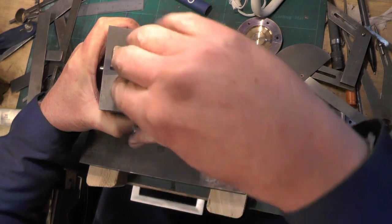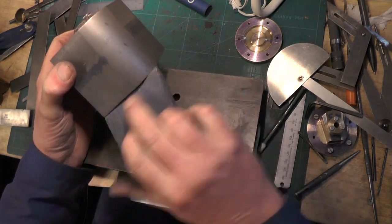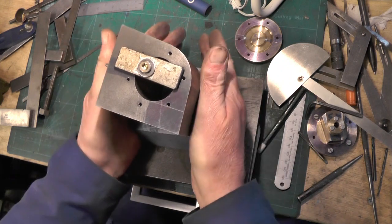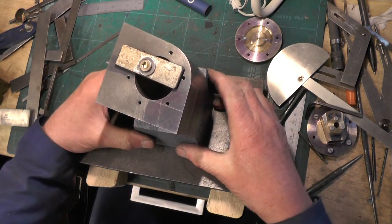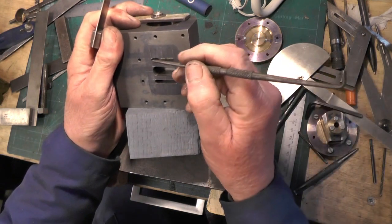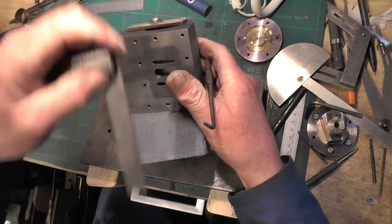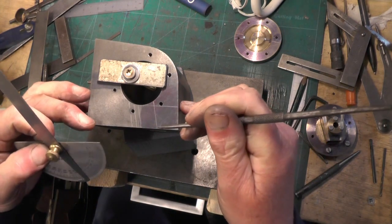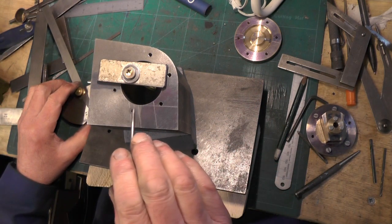That's your 12 and a half degree angle, and then you've got your 20 degree angle that way, so that's giving you your compound angle. We're going to set the block up on the milling table square and parallel to the table, then put some stops on. Using a square, transfer your lines up where the ends of your slots are on both sides, then draw the lines up at 12 and a half degrees from the point they come onto this face — that's giving you the area of the slot you've got to work with.